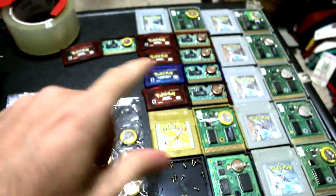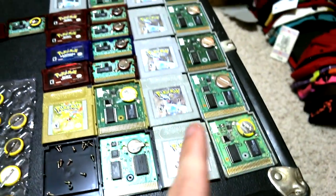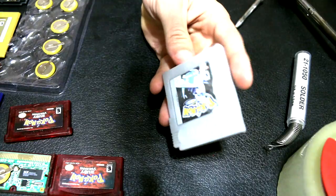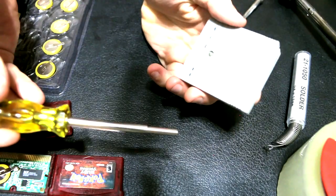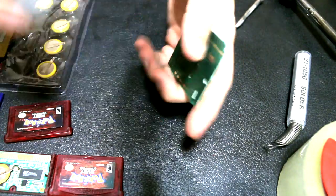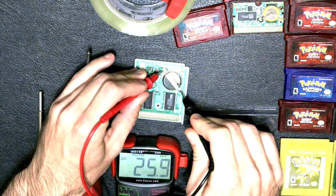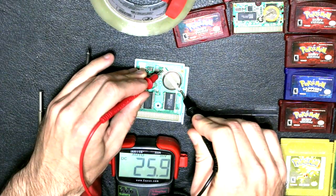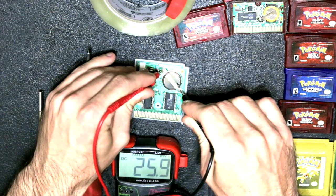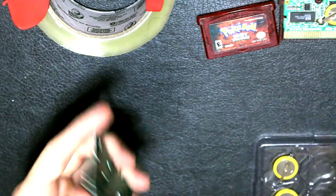It's time to do some maintenance and change your battery. For the original GameBoy and GameBoy Color Pokemon games, you're not going to be able to maintain a save state, so that is going to be an issue. Another way you can tell if the batteries are dead is by using your multimeter. Take your 3.8 millimeter game bit, open it up, slide the top down, expose the bare cartridge, press the negative terminal on the negative and positive on the positive. If you're getting a reading in millivolts — right now I'm at 26 millivolts — that's definitely a dead battery. Anything under 3 volts, you're going to want to change.